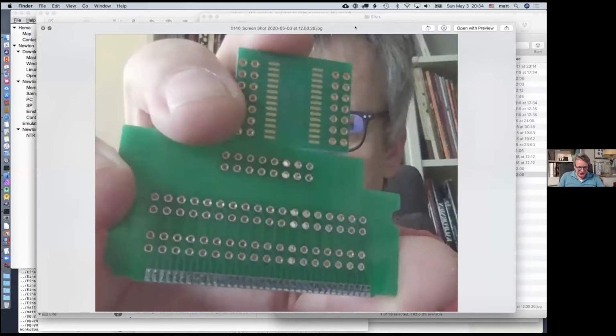To do some experiments with adding my own flash, the idea was that today's flash chips have easily 64 megabytes of storage. So we could actually put 2 flash chips on there, one for the lower 16-bit, one for the higher 16-bit, and then see if we have custom versions of the ROM, and at the same time additional flash memory all put into one single chip. And so my plan was to have these printed circuit boards made, and then wire something with air wires to see if I can get that going.